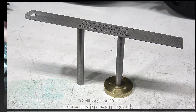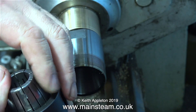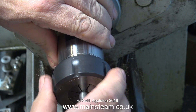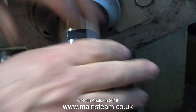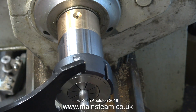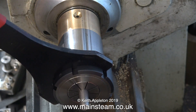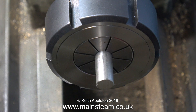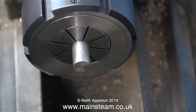I cut the piece to the same length as the original crankshaft, and for increased accuracy I've decided to machine it using one of my ER40 collets. In this clip I'm fitting the piece of stainless steel firmly into the collet using the special spanner that came with the collet chuck when I bought it. This ER40 collet chuck fits into a Morse Taper No. 3 hole in the lathe spindle, and I don't really like this because it doesn't allow the bar to go all the way through, as it has a draw bar in the back.